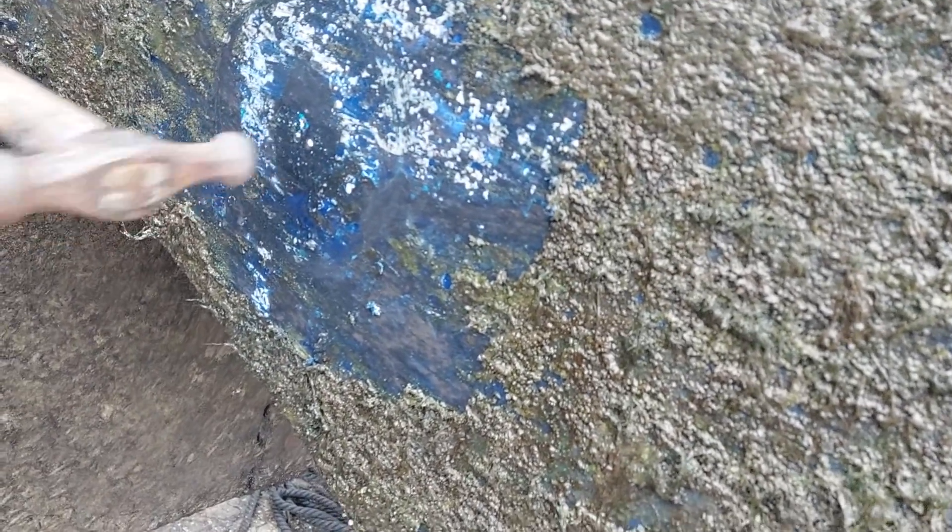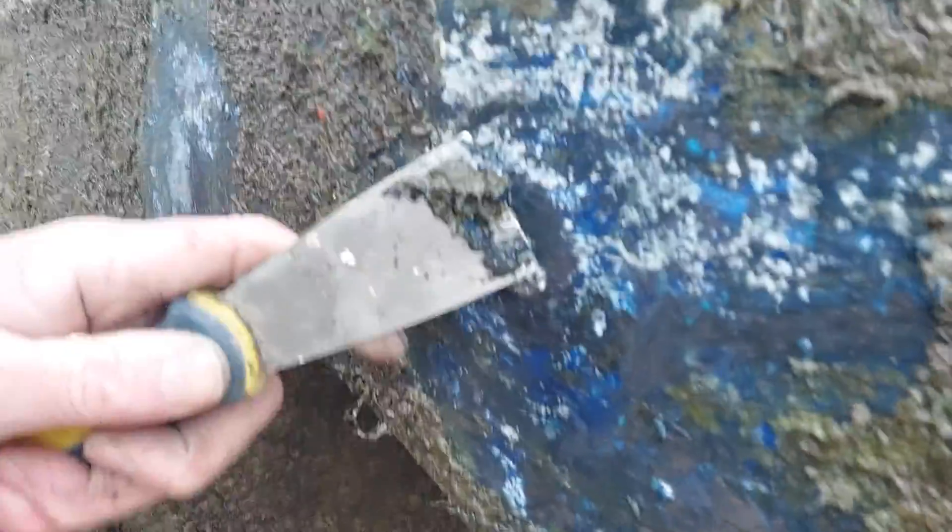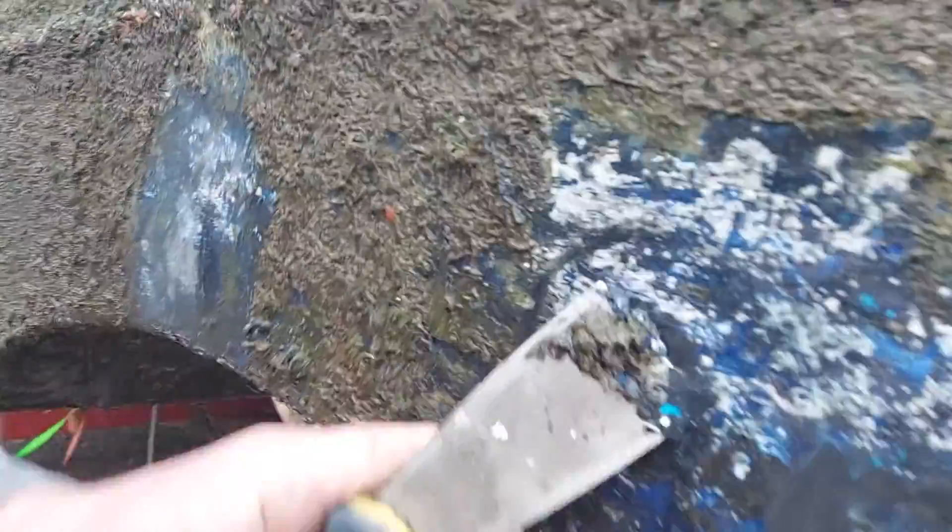I'm going to use my old dad's hammer — tapping around it, softening it up. Watch this: when I get to the middle of it, all of that laminate has gone. It's blown the complete gel coat off. So I'm going to very carefully open this one up with my spike so you can get a better look, because a lot of people ask me what wicking is.